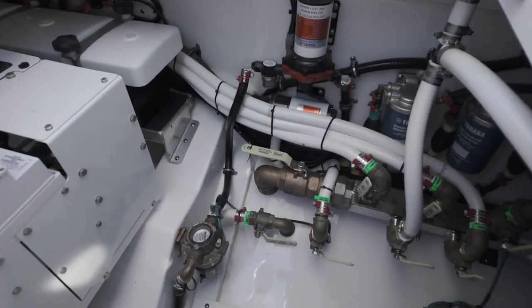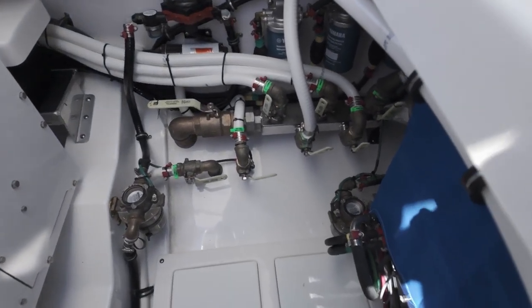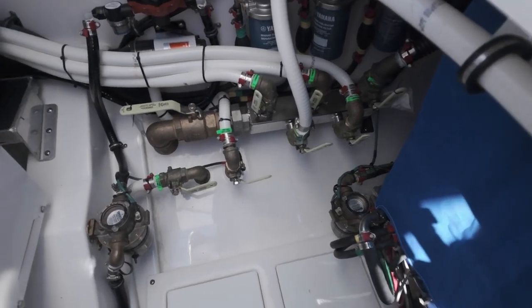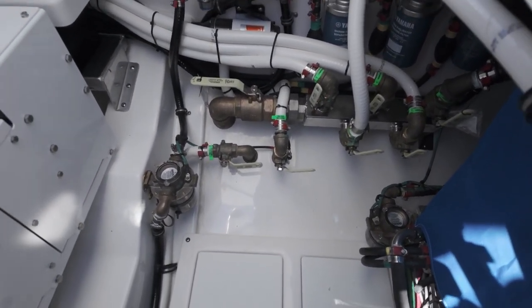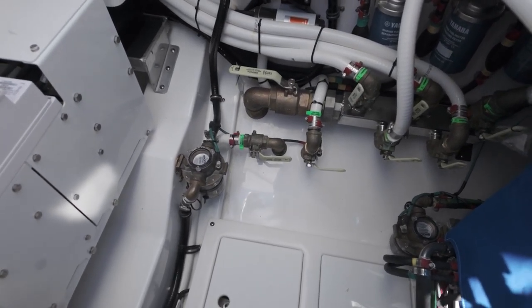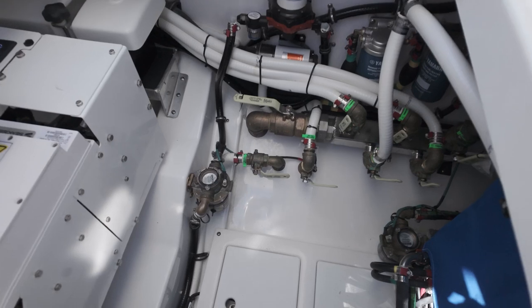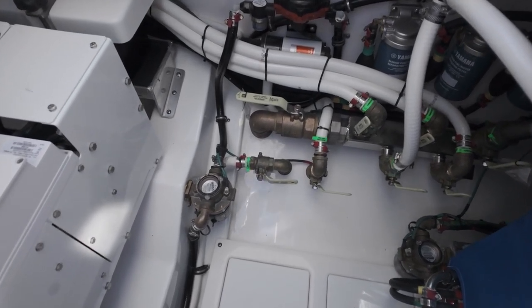As noted from the beginning, look at the finish of this fiberglass in here. It is not rolled, gel coated. It is not back gelled. It is a finished fiberglass. And if you look at the Seakeeper 6 cradle, we make that internally in-house. Again, a finish. The Seakeeper is tucked forward, out of the way. Very easy. I can get down and access anything in this bilge, not only for service, but in case of emergency.